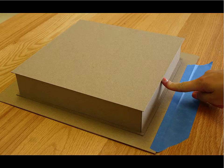And now it gets even better because the weak part of that wall was out near the center. And if we come with a roof diaphragm or a floor diaphragm that stabilizes the top edge of that wall, we have yet another intersection of mutually bracing sheets of material. It's an incredibly important concept, which, by the way, is used in more than 99% of the modern buildings that we design. You just don't find buildings very often that are somehow stabilized by their dead weight.